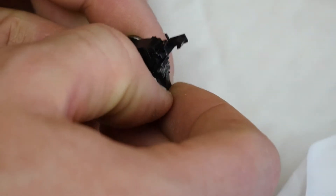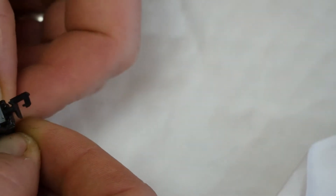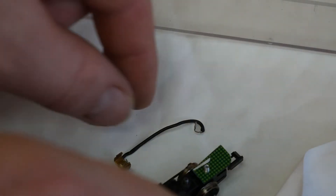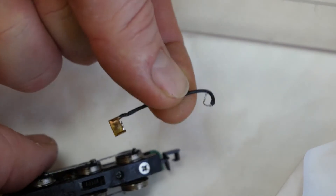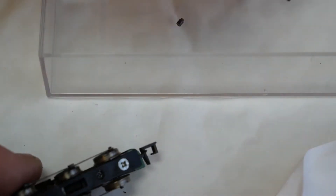It also means I'm not going to lose the couplers and the axles aren't going to fall out. Next up is to prise off the upper brush clip. Under there you can see there's a spring and the brush. I then undid a screw which released a nut, so I could remove the wire that holds the upper brush clip in place. This is going safely in my plastic pocket.